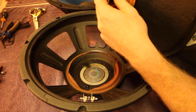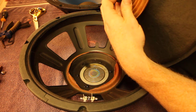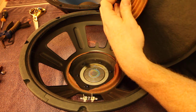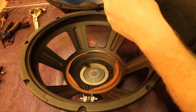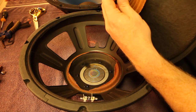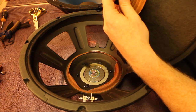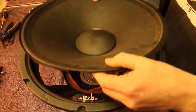A lot of these amps, especially the budget ones, don't have any limiting. Once you push them they start clipping and start delivering almost a square wave to the speaker. There's a lot of contention over this, but it seems logical — and guys who know a lot more than me are saying that when you start delivering a square wave to a speaker, its average voltage goes through the roof.